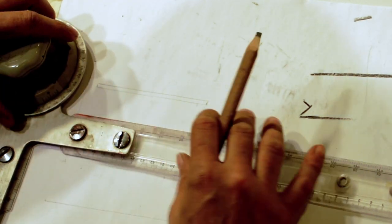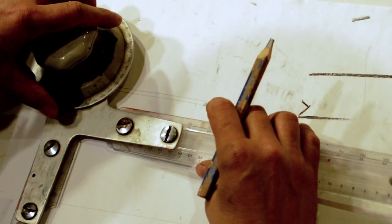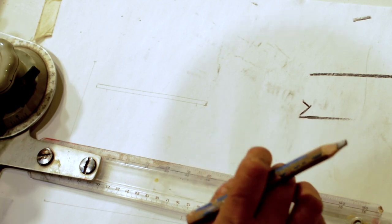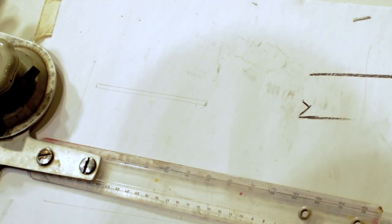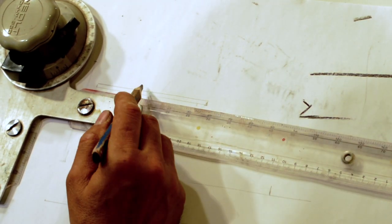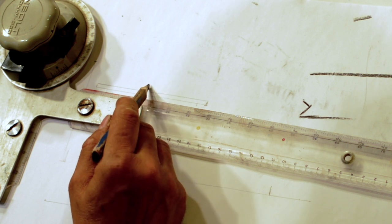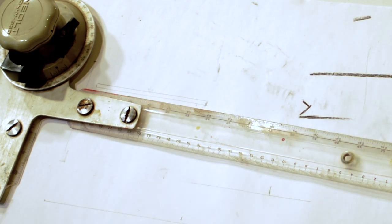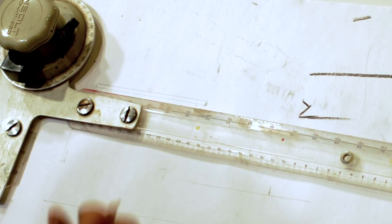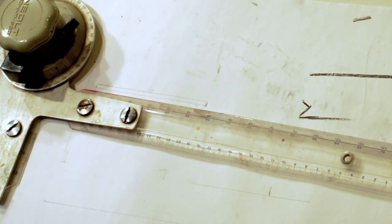I want these to stick out 50 centimetres because it protects the standing beams to have a little bit of extra roof in the end. Could actually conceivably be even more than that. And the more you have, the less weight you put. It acts as a cantilever. You know, the forces reduce, the closer these are together, the less weight you have on the middle part.